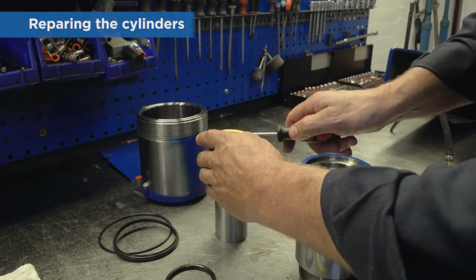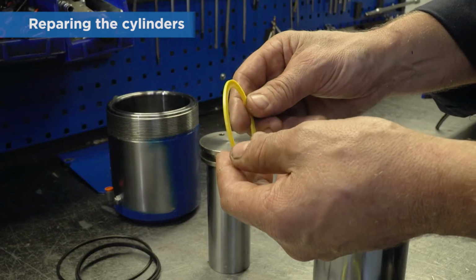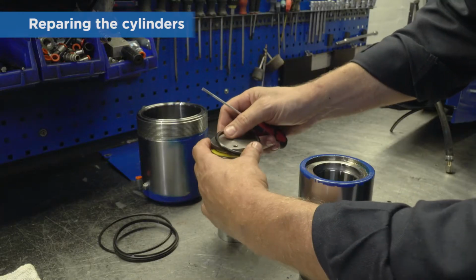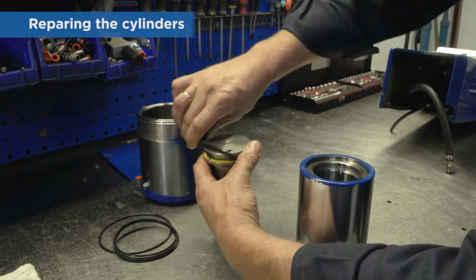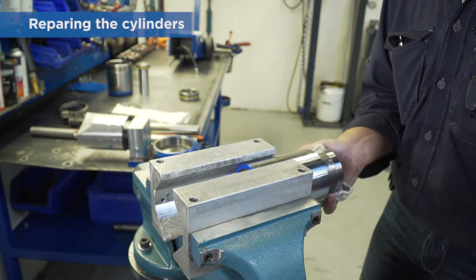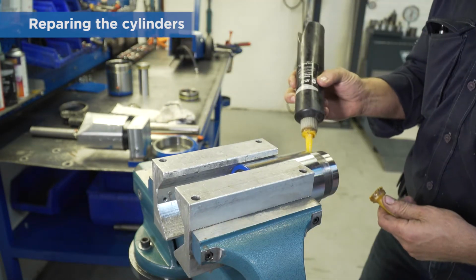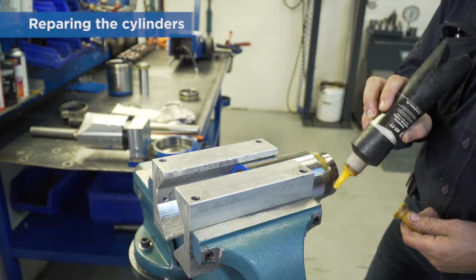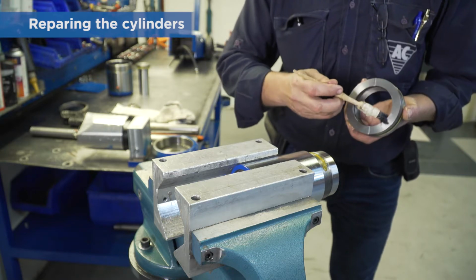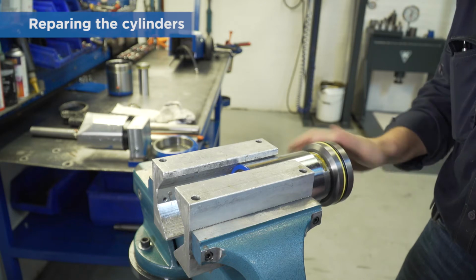This is how the seals fit the cylinders. Keep in mind that the yellow backup rings are bowl-shaped, so the black O-rings fit into them. Secure the 100mm piston with a little glue and lubricate with grease before refitting the parts again. First fit the 100mm piston into the middle cylinder.